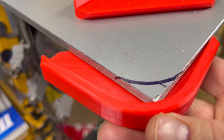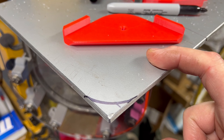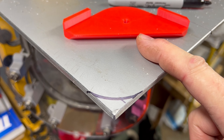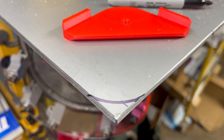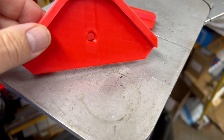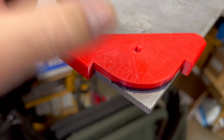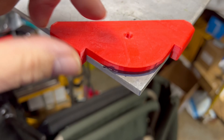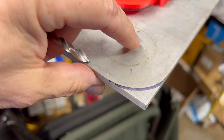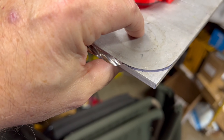I have two of these plates — one for this saw and one for the other saw. Something else I didn't mention: how are we going to hold these on? I want to bolt them on and off rather than glue them. I have this hole here as a guide for a number-7 drill — I'm going to use this as my drill guide, drill a number-7 hole, tap it to quarter-20, then put my piece on from underneath and use a half-inch quarter-20 bolt to hold it on.